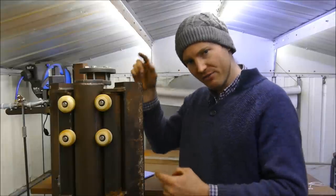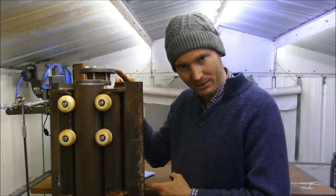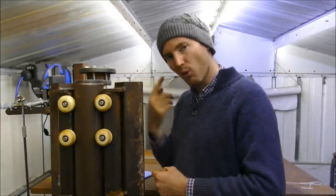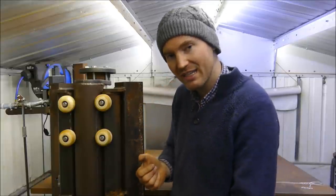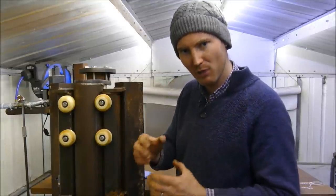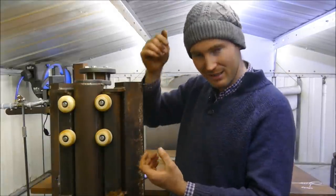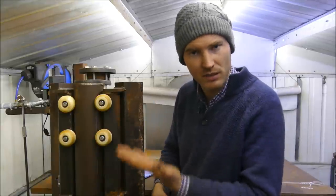The cylinder being inverted as it is, compared to other power hammers like Big Blue, I believe works better. The reason being is that it's mass times acceleration that gives you the impact force, not the pressure of the bore of the cylinder itself. So the whole area of the bore of the cylinder is important for sending the hammerhead up to lift all of that weight. But then you want to send the hammerhead down as quickly as possible. Well, you've got gravity to help you with that, and having it on the rod side, which means that there's less volume of space to fill with air, then it's going to send it a lot quicker. Some may disagree with me on that, but because physics, it works.